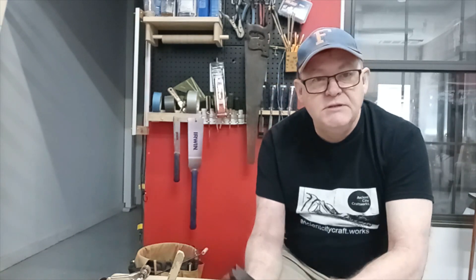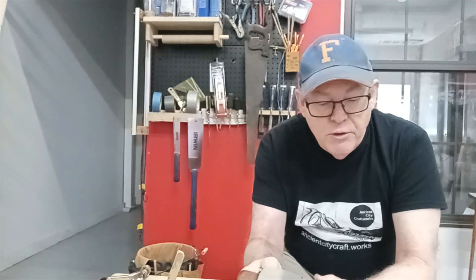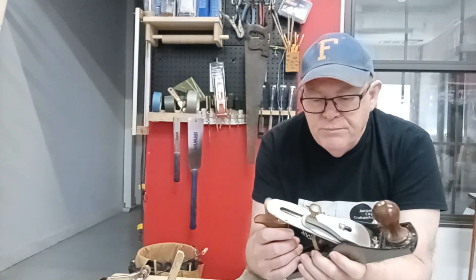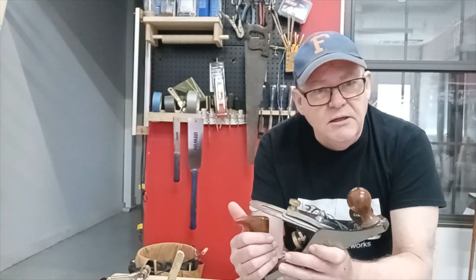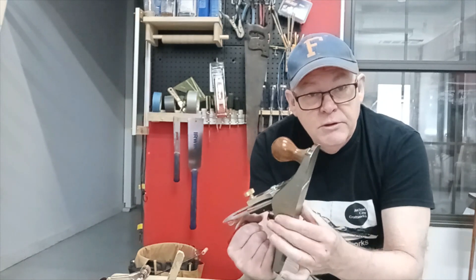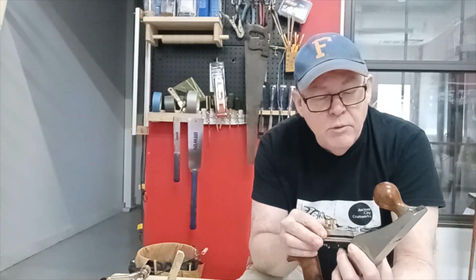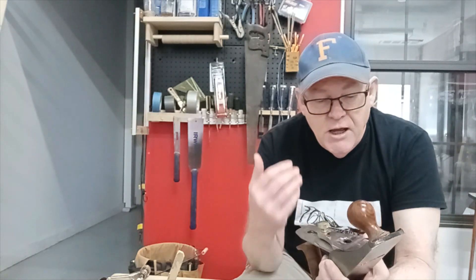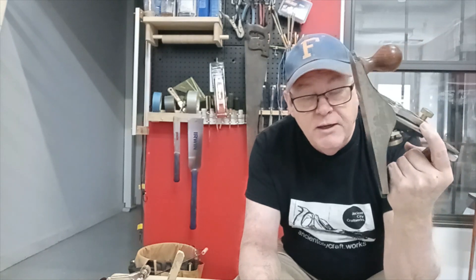The cheap Amazon purchase I'm probably most pleased with is this number four style hand plane. This is marketed by a company called Spear and Jackson, and the plane was actually made in India and just branded for Spear and Jackson. When I watched some videos online there are mixed reviews out there, so maybe I just got lucky and ended up with a good one. The bed was surprisingly flat, the sides were perpendicular to the sole and flat, and the blade came relatively sharp. I could actually use it out of the box and start getting some good shavings. Once I honed the blade up it worked a lot better, and this is now my everyday go-to plane — works extremely well. Paid about $30 for it.